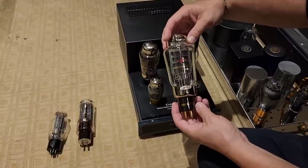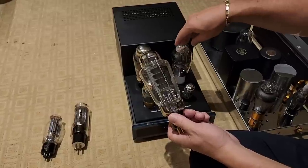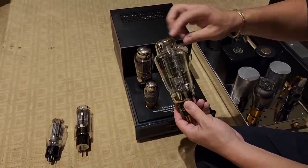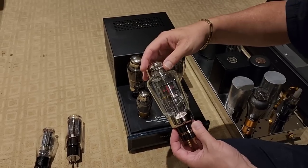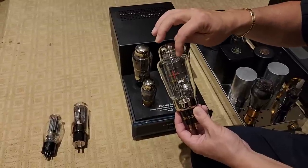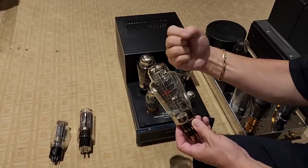Here is a variant of a 300B called the 300B XLS — a beefier 300B. The standard 300B can only get 8 watts out of it. If you find something claiming to be a 300B with more than 8 watts, that's a red flag. With the 300B XLS, I believe you can get 10 or maybe 12 watts. Look at how much more heavy duty it's built. If you just put it into a regular 300B amp, you're going to get more slam and dynamic punch than with a standard 300B, which is very flowy. This one has a little more muscle and grip.